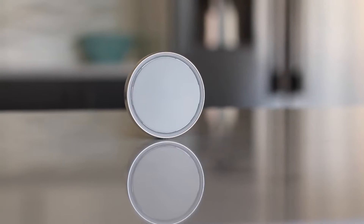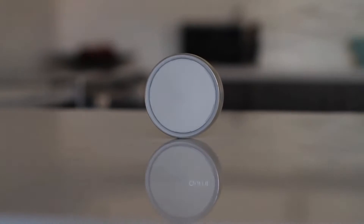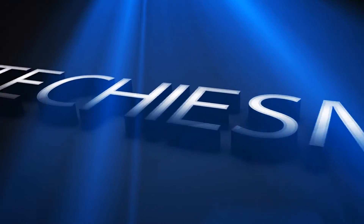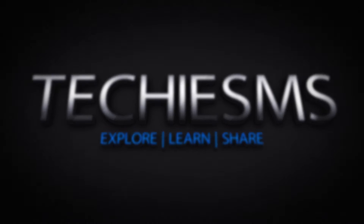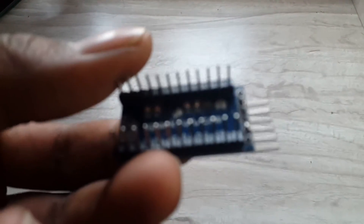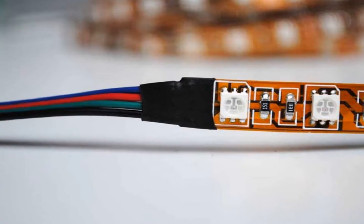If you want to know more about this product, you can watch my tech update video containing the clip of OMI. I've found this product simple and attractive, so I studied it and turned it into a DIY project. For making OMI, I have used an Arduino Pro Mini board, an HC-05 Bluetooth module, a rotary encoder, and an RGB LED chip.